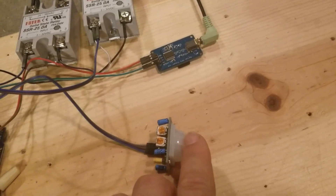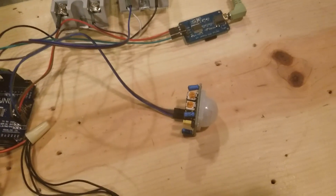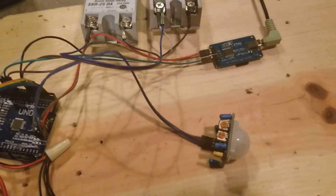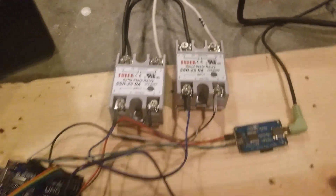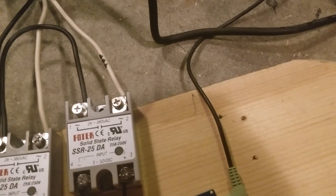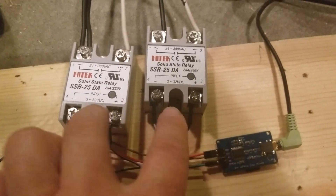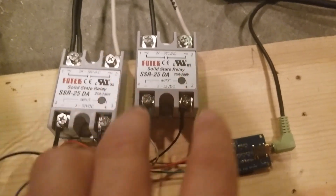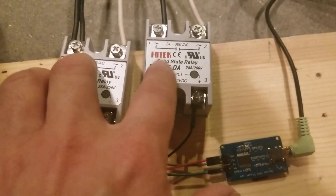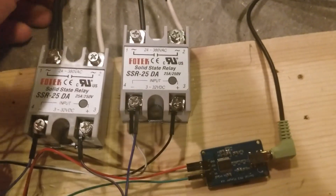And that all happens when the PIR sensor is triggered. You've got 5 volts going to everything from the UNO. Same thing on the solid state relays — 5 volts going in, piggyback common ground connected, and then power going in which will open or close these relays depending on how you have them set up.